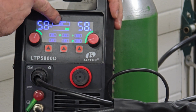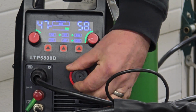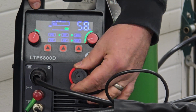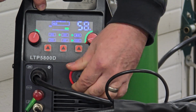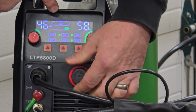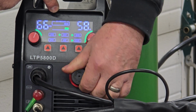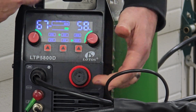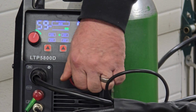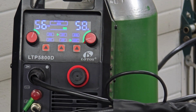And it has these 3 marks here. Now watch, if I pull the lock out on here and I turn the air pressure down, you'll see this is going to move to your left there. So it's saying, hey, that's low, that your pressure's too low. And if you go turn it back up, it goes into mid. And if I keep going, keep going, Okay, now we went into high. So they're saying you're, you know, higher than typical. So put it somewhere in the middle. Now that changes. Lock that in by doing that.